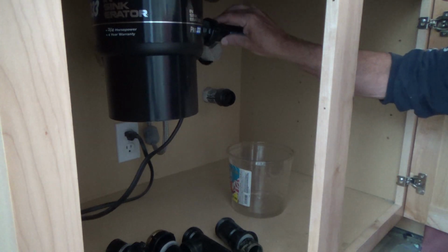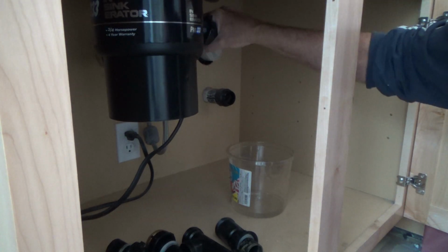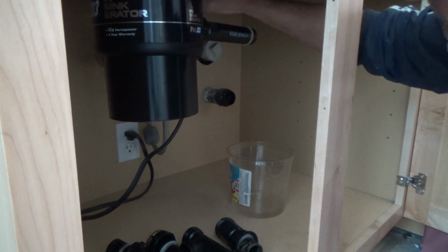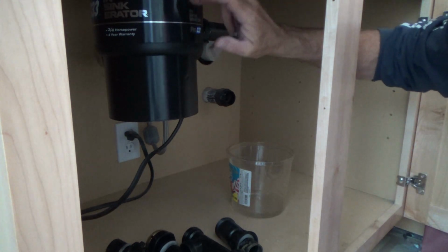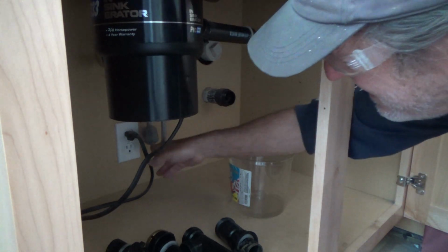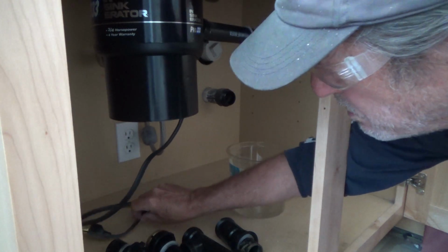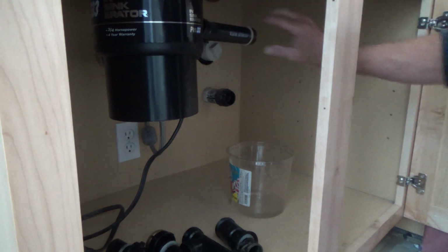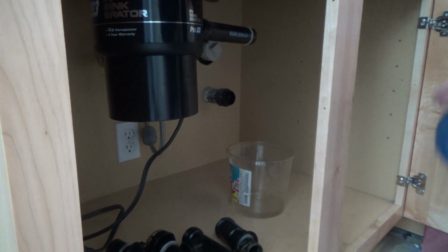Okay. All right. So now a couple screws here to pull this extension off, and a screw up here to pull this big pipe that goes up to the air gap, and I'll be ready to disconnect the garbage disposal. What I should have done was unplug that garbage disposal first. I got it down now, and I'll finish taking this pipe out of here and this other one.